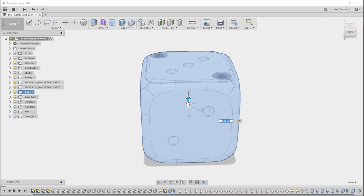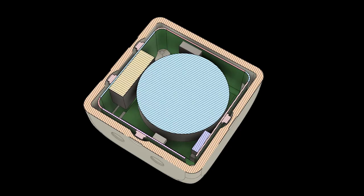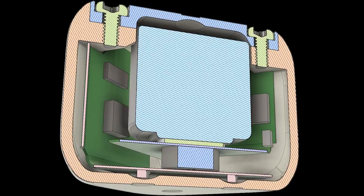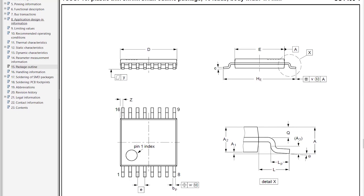The thing is, when your tolerances are this small, you have to do your component layout at the same time as you preview things in 3D space, so you can see how everything is going to fit together. And at this scale, a chip that is a millimeter thick is actually significant.